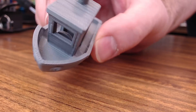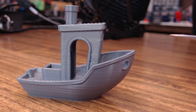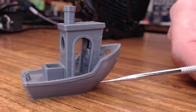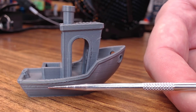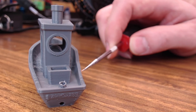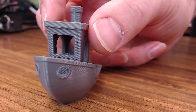Now the Mini. The first thing I noticed is there are just a few strings down in here. You don't have that same driver noise that you see on the Mark III prints. Looking at the wheelhouse, you can see this inconsistency right here — I see that a lot on Bowden-style printers. Probably a little bit of retraction tuning could make that even better. Same kind of inconsistency down here, and a little bit of a strange effect in here for the Mini — not sure what that is, but it's really only noticeable at a micro level. About the same for the back, maybe a few more blobs than the Mark III. The license plate probably isn't quite as legible. Really nice finish on this side, none of that driver noise. Bridging looks really good. Again, a really respectable print.